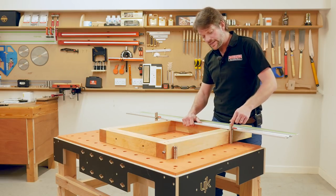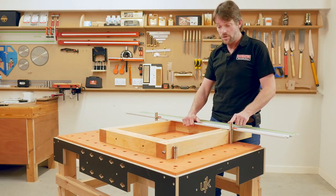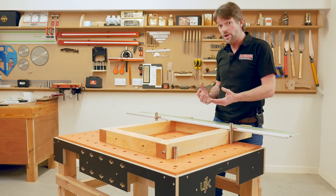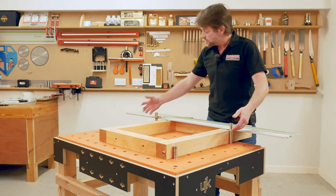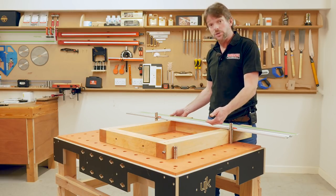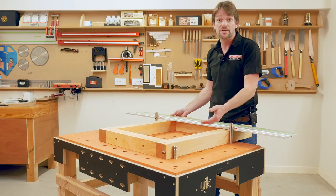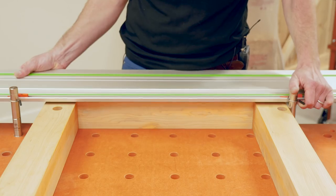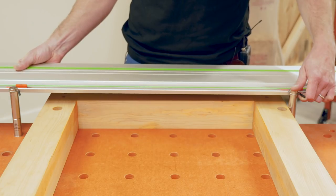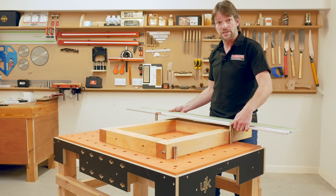We made these 120mm above the table. Whereas a lot of saws have a maximum capacity of 70mm, we thought it was useful to give this extra height in case you wanted to do trench cuts in thick timber — say 100mm or 110mm. You still have plenty of capacity underneath the dog to do trench cuts in thick timber.